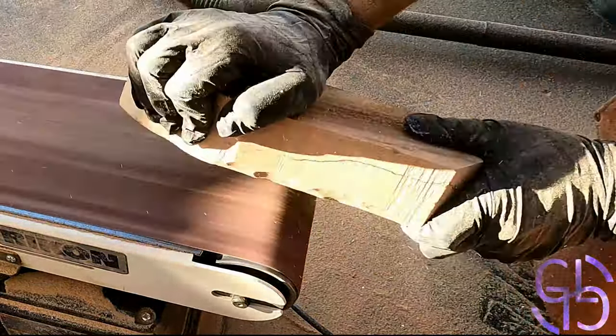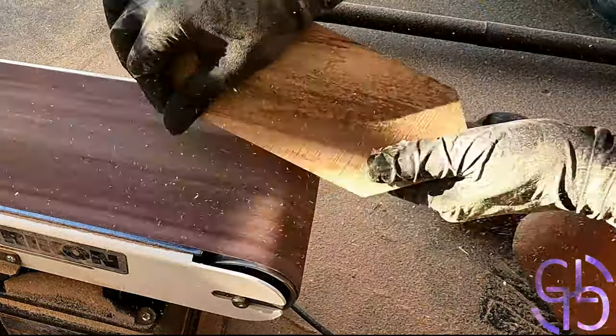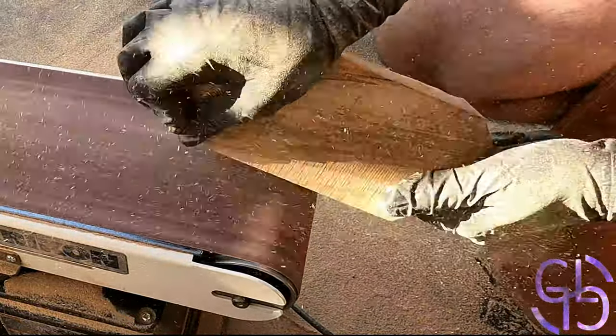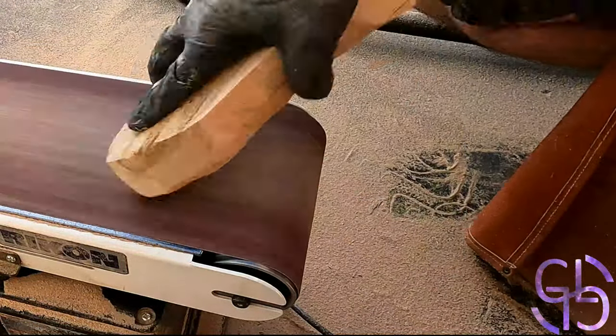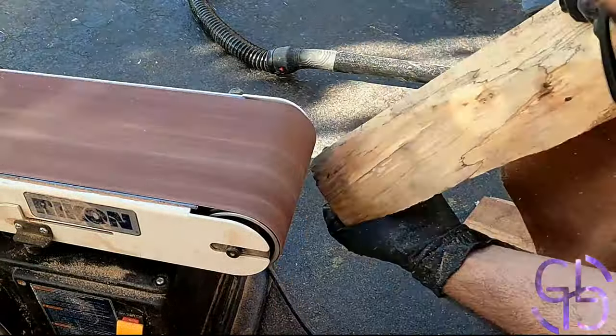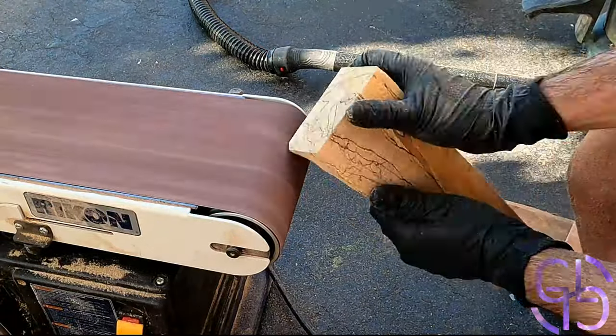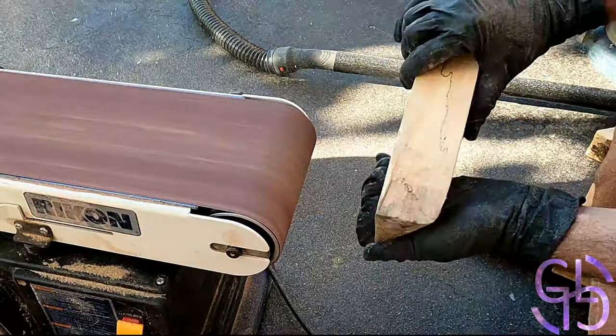As the first step I looked at the pieces and chose the best corner I will use for the board's corner. Then I used a jigsaw to give shape to the offcuts and cut cracked and damaged pieces of the wood off. It was starting to look pretty cool. I used the belt sander to give nice rounded smooth and fancy waves to the offcuts, but I ended up with a giant gap in the middle since I only used the leftover wood pieces from the offcut itself.